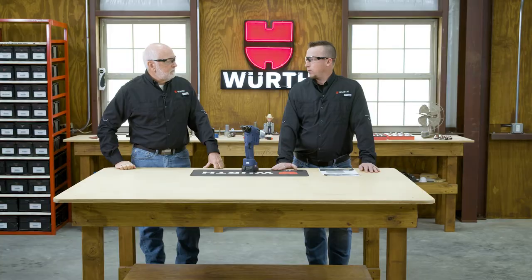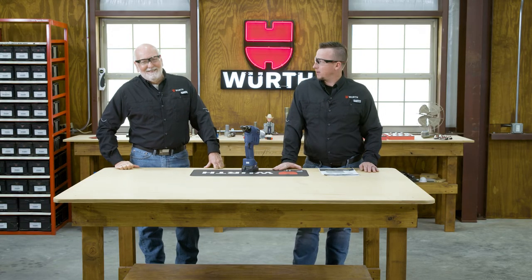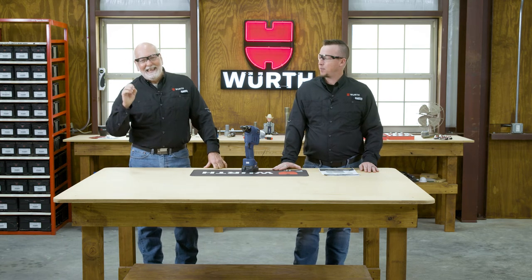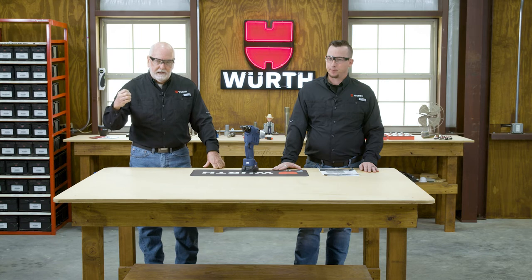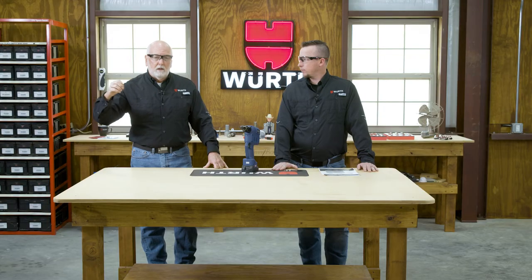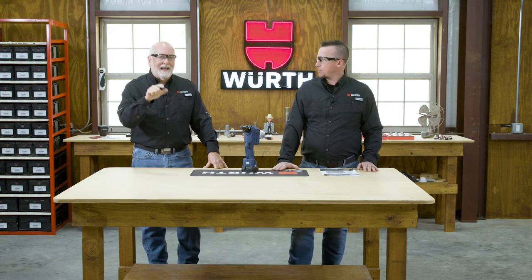Or head popping, or head popper, sometimes referred to as. What that refers to is the head of the mandrel, that little round head on the end of the mandrel that upsets the rivet. That pops out. That's usually because your material is too thick for the maximum thickness of the rivet, or your hole is too small. That will cause it to pop out on the backside. But usually it's that your material is too thick for that rivet. Make sure you choose the right size for the thickness of material.